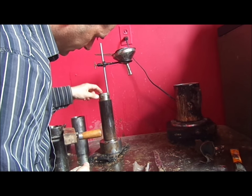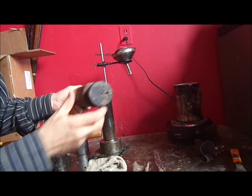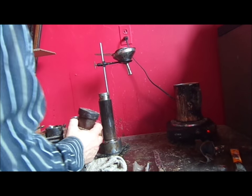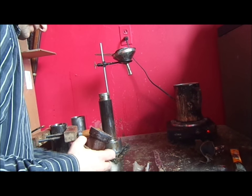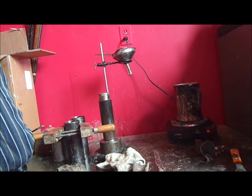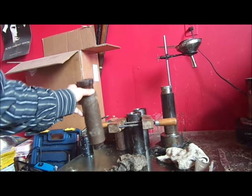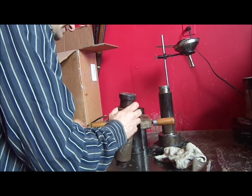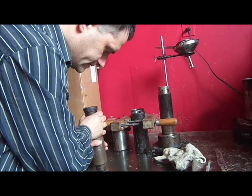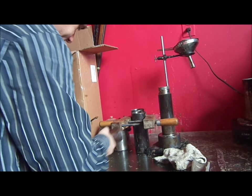Yeah, notice that the record is still quite plastic. By the way, this is one that's been cooling onto the cooling mandrel. This keeps it from warping the record. While that's getting a little bit exposed to the air, we're going to remove this piece then from it. So this is lubricated mandrel, and a couple of little wraps on there, you'd think it would break the record, but it doesn't.